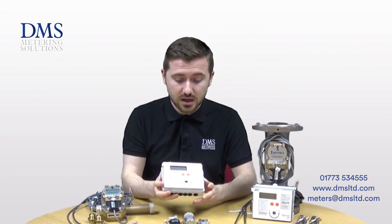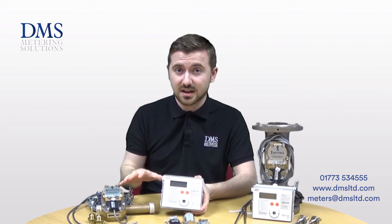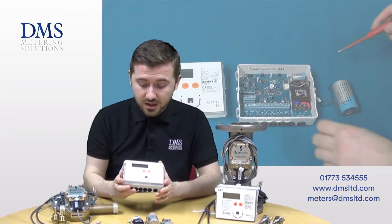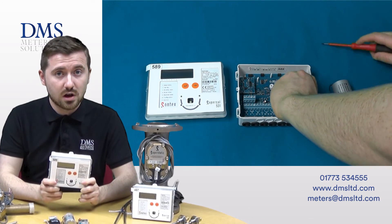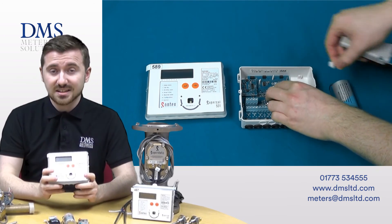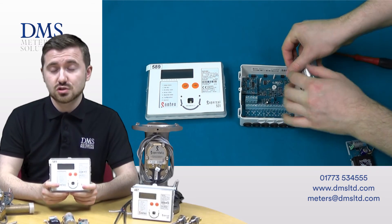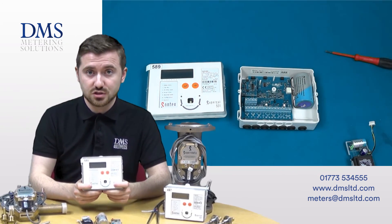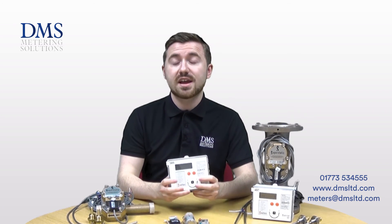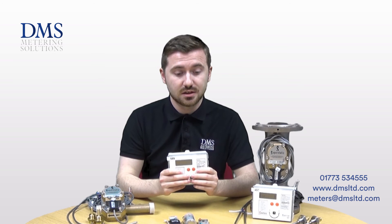The integrators are calibrated to be paired very specifically with the 440s, so they must not be split up from their corresponding flow part. These are available with either mains power or battery power, and there are even low voltage versions of 24 volts AC or DC. As standard you get an M-Bus and a pulsed output from the meter for energy. There are also two additional module slots which can take RS-232, BACnet, Modbus, LON, and analogue outputs — a whole range of outputs that the 531s can provide. Have a look at the data sheet or discuss it with us and we'd be happy to take you through it.